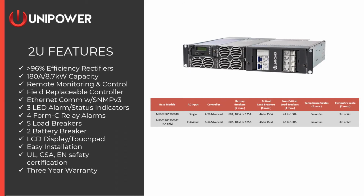The controller is field replaceable, as well as the modules are all hot swappable. The communications done through SNMP v3, so they are secure. And the modules and the controller have LED status indicators on the front. So if you were to look at this unit in its installation, you'd be able to get a quick view of the status just by looking at the front of the unit and looking at those LED indicators.